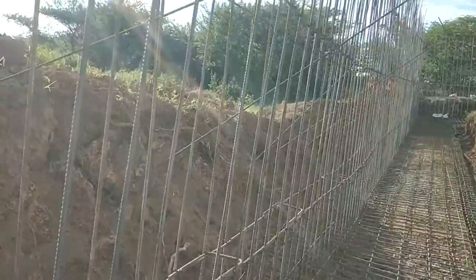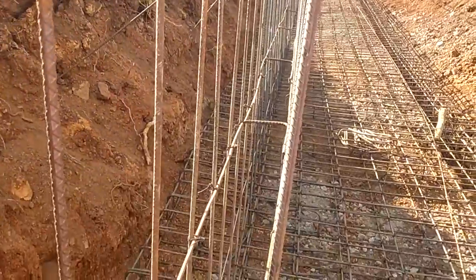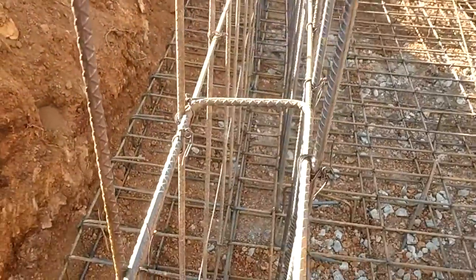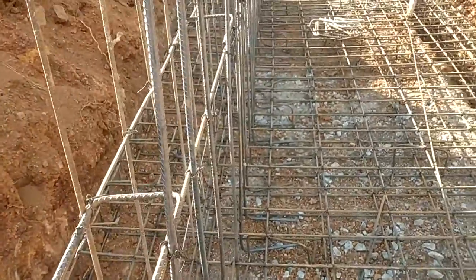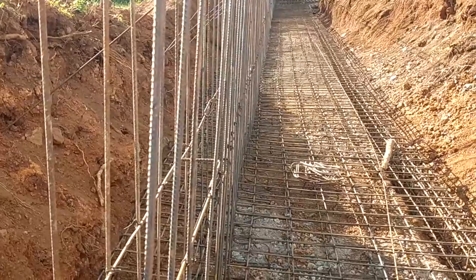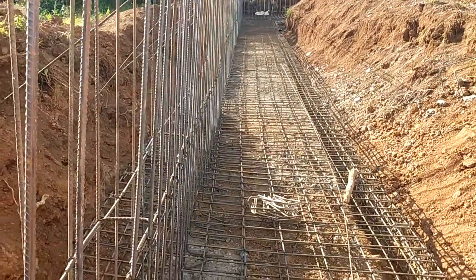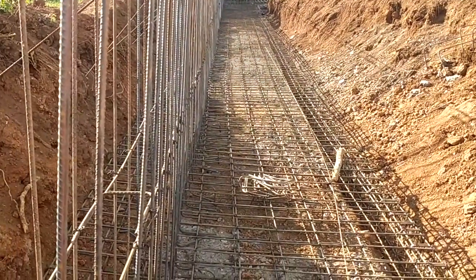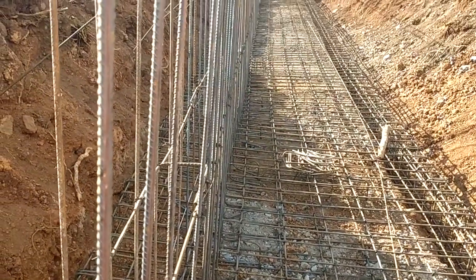Here is our wall, and there's something you'll observe — we have actually two separate lines. These are reinforced bars separated so that you have a uniform distance between the two. The distance for separation you determine on site, and the size of the bars you'll have to determine according to the strength of your reinforced concrete retaining wall. It's quite important for you to actually have a structural engineer to quantify what you need and give you the correct design according to the application.